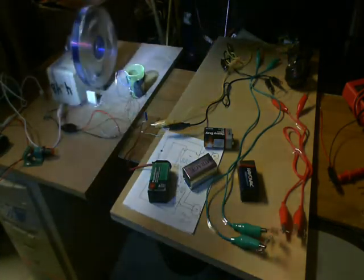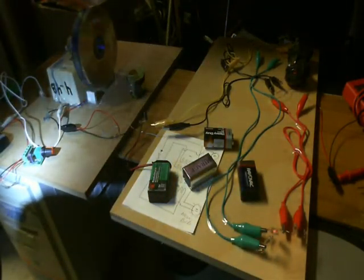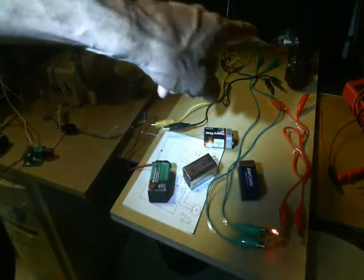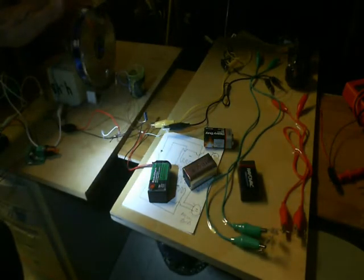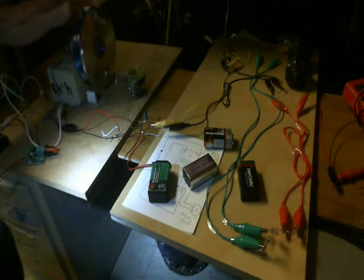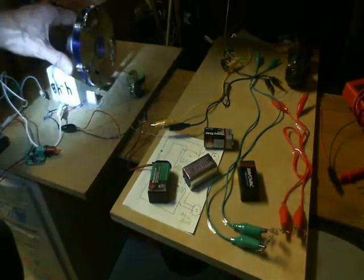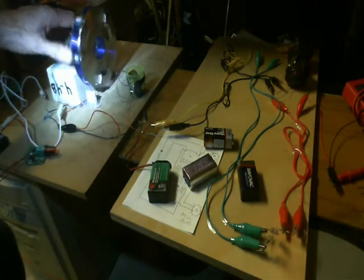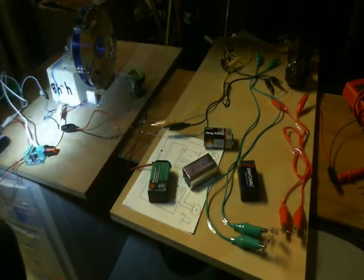I had initially planned on putting a neodymium magnet in those little coils on each side — we just wanted to run some tests first. But this was a good explanation of what has to happen in those coils to get the maximum amount of power. As I showed turning it slowly, you're getting the maximum amount of time needed to get the full pulse out. You can actually get this motor to switch itself on and off using the same technique, and you can put multiple brushes around to pulse more coils at the same time.